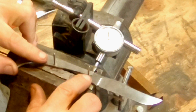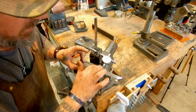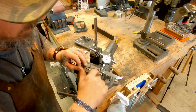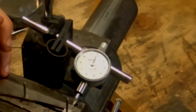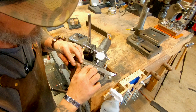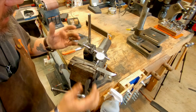The thing you don't have on this setup is the spring — you actually have to hold the spring tension because this doesn't really have enough spring tension to hold up. Hold spring tension on the back of the spring, then you can check your rotation exactly the same way. These pins are probably not identical in spacing to what I had set up on the Rupal gauge, so I may get a couple of different readings. It's all about the relationship between the spring and the notch. If you start with this and get this relationship set up just right, then your numbers will be consistent as you go back and forth to tune up the knife. So on this one I'm pulling a little more than five, looking like about seven, and in the closed position it's pulling about 20. The relationship has changed slightly, but I paid $20-$25 and saved the few hundred dollars that it would cost to buy an actual Rupal gauge.